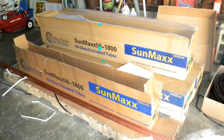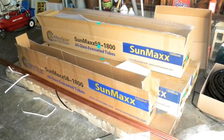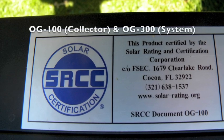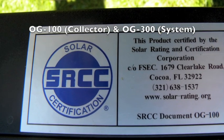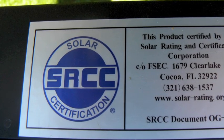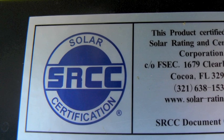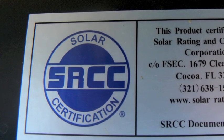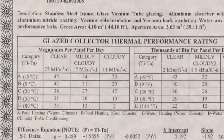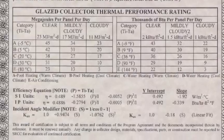We're just about to begin the installation, but let's go over two critical points you need to know before you design a system and purchase a product. Number one is SRCC certification — in particular OG100 and OG300. This independent third-party organization rates and certifies solar thermal products for design, durability, reliability, safety, operation, service, installation, and maintenance, just to name a few. It is in every consumer's best interest to make sure your product has both of these certifications. Not to mention, some states will not provide incentives or rebates without it.